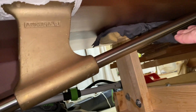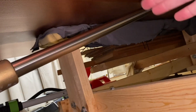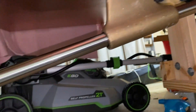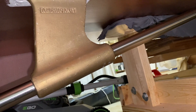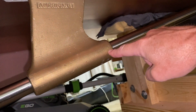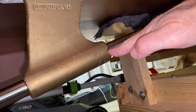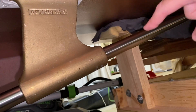I wanted to talk about getting the angle of this prop shaft when it's in the boat, specifically where it connects to the engine. Right now I've got it extended out, and I'll explain why in a minute. There's a natural angle that this strut actually wants the prop shaft to be at from a vertical standpoint.